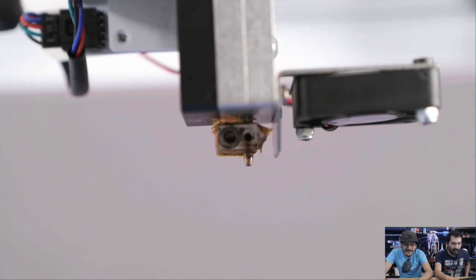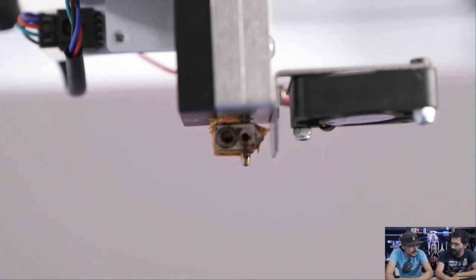We're not very big fans of the auto leveling procedures that the Lulzbot Mini has or the PrinterBot has, because the Z probe can be problematic sometimes. It can be problematic, yeah, and it's so frustrating when a print starts and all you have to do is move a corner down by half a millimeter, and it doesn't allow you to because it's all auto sensing. Yeah. So that's a very big pain in the butt when you have a needle just crash down into your build plate, when a minute ago you had a perfectly leveled plate that had a successful print, and now all of a sudden it's completely unleveled. Yeah. So there's a little trade-off there, but this machine has a really good way to level it with the bed plate and the thumb screws.